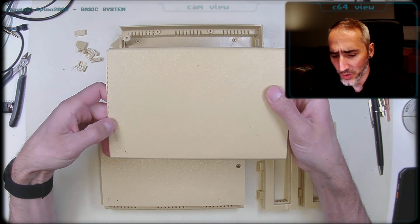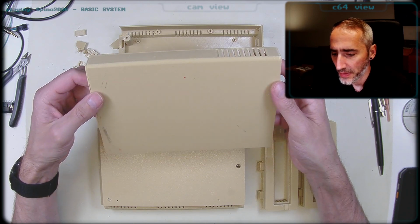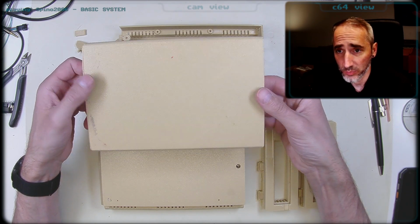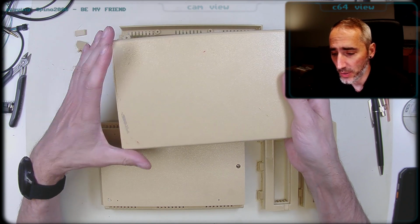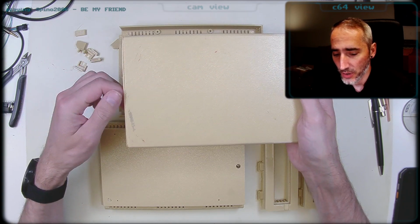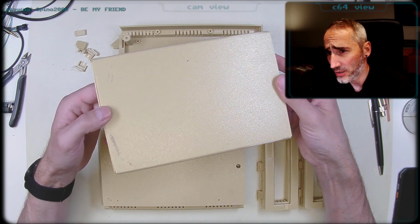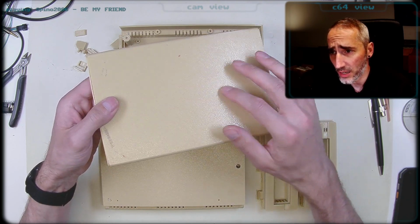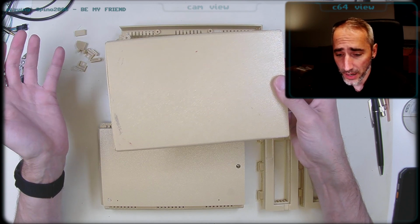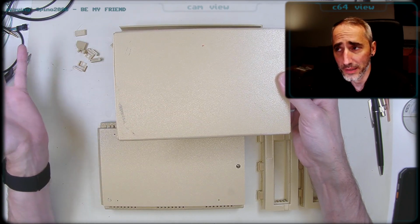And as you can see, there is some smudge and some strange color here and there. This is one of the things I have experienced. My printer bed wasn't completely clean, and so this lid, this surface, picked up some leftovers on the structured printer bed. As you can see, it is not smooth. It's not flat, it has some structure. And within this structure there was some, I think, leftover material, which was quite hard to spot because it had almost the very same color as the printer bed itself.